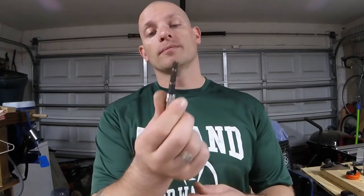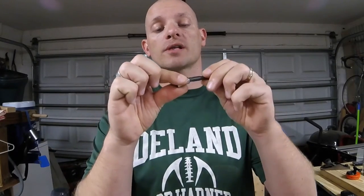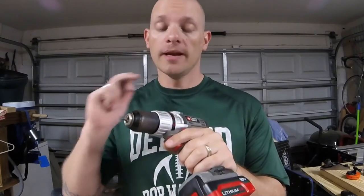Also, your drill will do more than just make holes and drive screws. You can actually drive much larger things, like lags, if you get the right attachments. This one is an attachment for quarter inch sockets. I've got one here for a three-eighths socket, and I've got them all the way up to a half-inch socket. Now, will this thing remove lug nuts? No, not this one anyway — you might have a super badass drill that will, and an impact wrench or impact driver will often take care of those. But for the little things I'm doing, driving quarter inch or half inch lags after getting the hole pre-drilled, these things work like a champ.